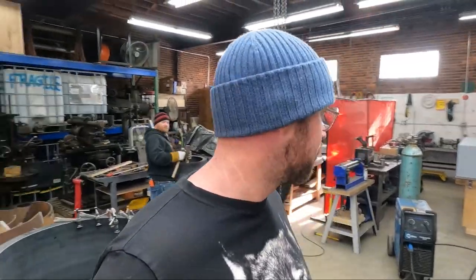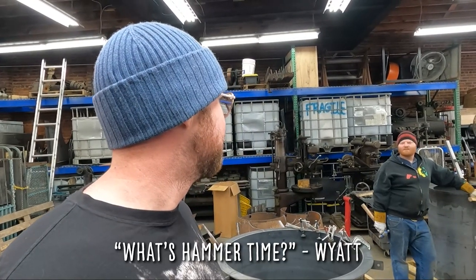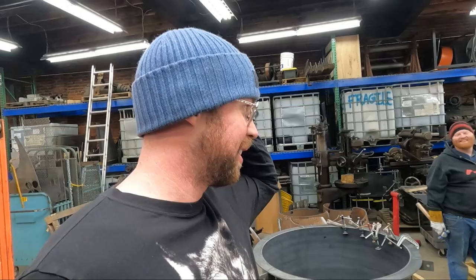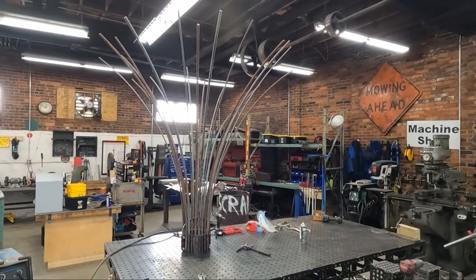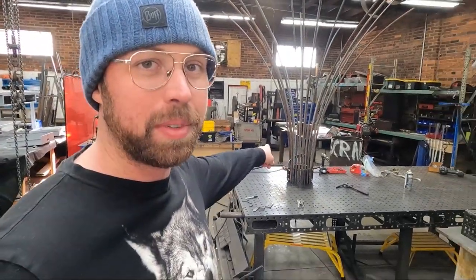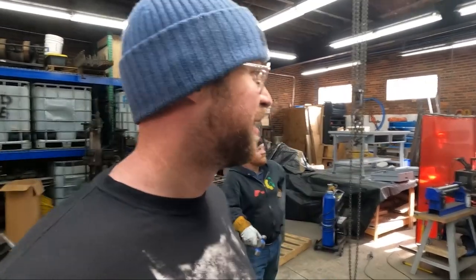Well, here we go. Back on the tree. I'm interrupting — why it's hammer time? That's not hammer time. What's hammer time? MC Hammer. Now stop — hammer time. You're thinking of Everybody Dance Now. I hope you enjoyed that, viewers. Here's where I left off last night when my welding torch stopped working. I've done nothing and it seems to have fixed itself. So I'm going to fully weld the bottom and then grab the torch, heat the bottom where the limbs meet the collar, and bend everything out into a tree shape. Weld little hooks on the ends of the branches for the stainless cable that'll hold the stainless tool shapes, then bring it to Black Dog, install it, and get paid. Weld time.